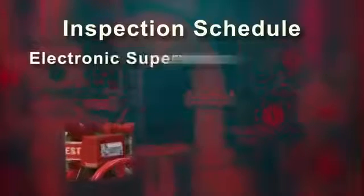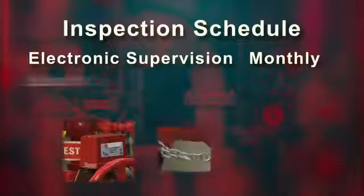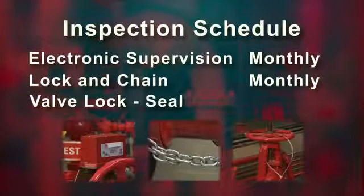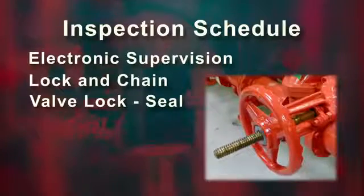How often do we have to inspect the valve? If I have electronic supervision, the valve has to be inspected on a monthly basis. If I have a lock or a chain, the valve also has to be inspected on a monthly basis. However, if I have a seal, the valve has to be inspected on a weekly basis. I cannot have a valve that has none of these.